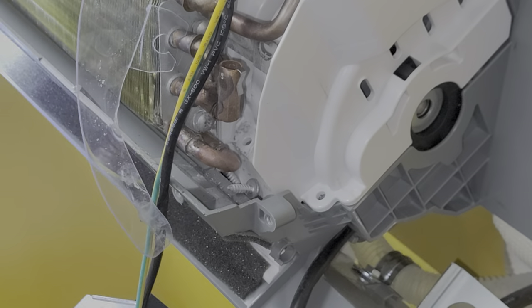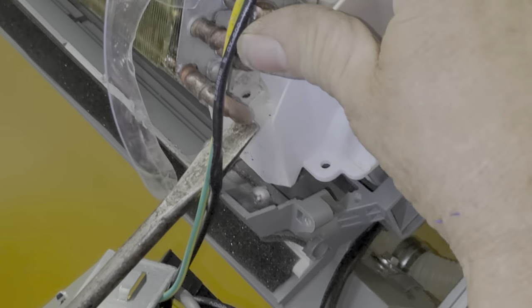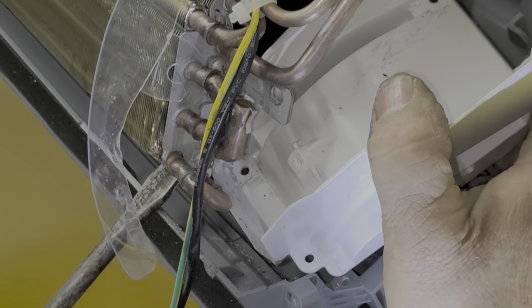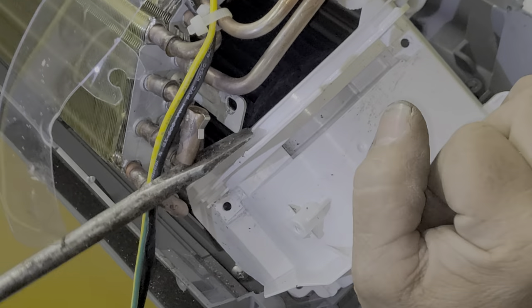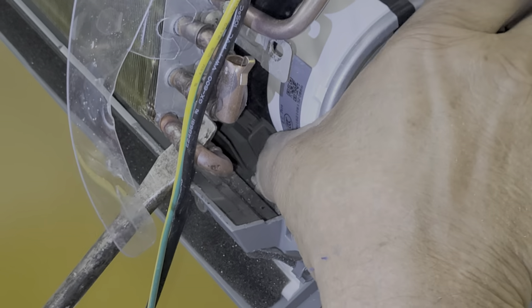While we've got that lifted up, this plastic piece has to come off for the blower to come out. You've got to lift it up because it needs to clear the inside, and there's a little effort getting it out — it gets caught on all kinds of things. Of course, half the challenge is that this unit is on the wall and you're having to stand on a step ladder, so the working conditions aren't perfect. There's your motor — if your motor ever goes out, that's where it's located. Lift up on the right-hand side and the whole thing comes out; you can draw the whole thing out, blower wheel and everything.